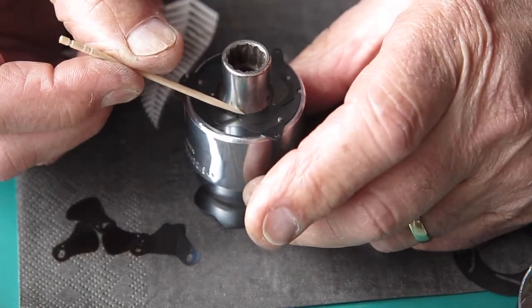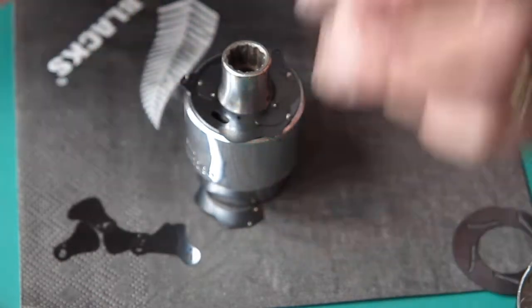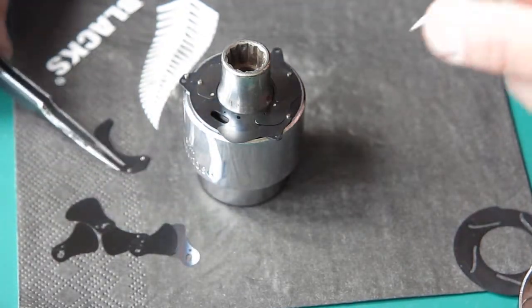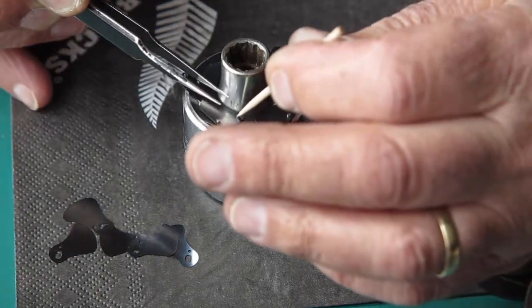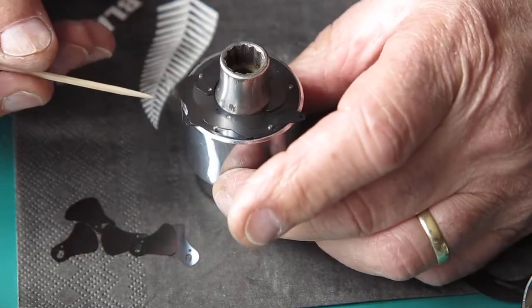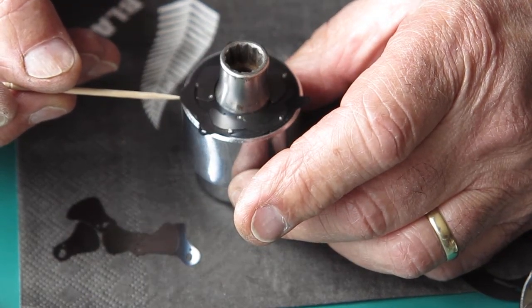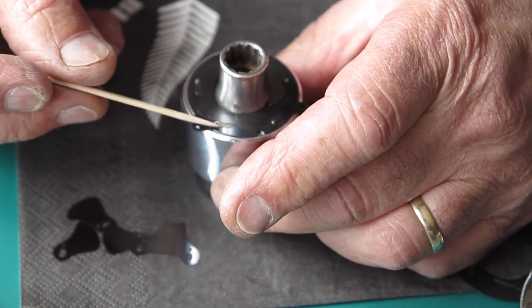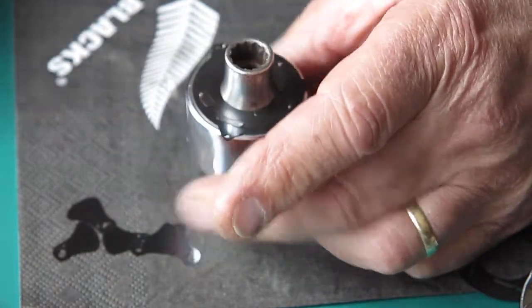And here, we've got to pull back both of these blades. And as you can imagine, when you're dealing with a shutter with 9 or 10 diaphragm blades, this is even more entertaining. Alright, so now I've got to lift the first blades back over the top of the pins here, without disturbing anything. Those blades are all in position.